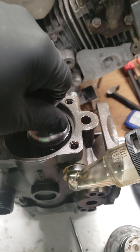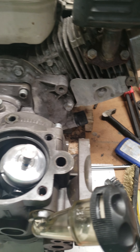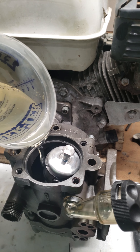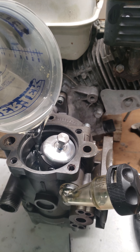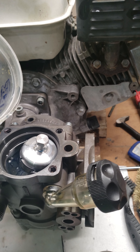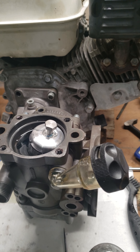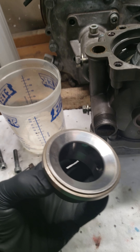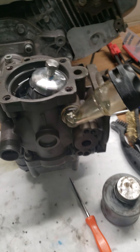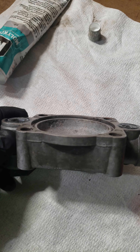With the pump tipped sideways I have the cylinder liner and the diaphragm out — there's a new diaphragm ready to go in. The cylinder is opened up, I've got the liner out with the piston and its ring, and I've got the diaphragm cap screw in the hole so I don't get oil where I've put a little bit of Loctite. So the plan is to just take the oil and pour all of it right into the pump. We'll get it up into the sight glass and let that settle out, then throw the cylinder liner and diaphragm back in and put on the cap.